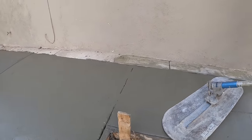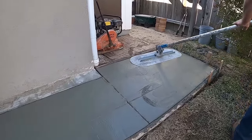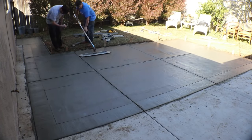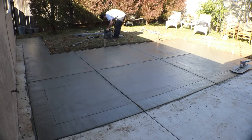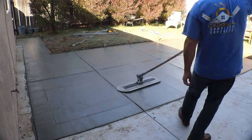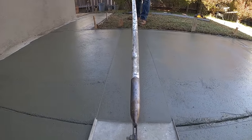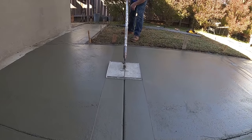So far I just cut it with the deep cutter, 2.5 inch, 3 foot long. That gets the joints nice and straight. It breaks the aggregate deep. And then I'll follow it up with a 3/4 deep, 1/2 inch walking jointer. Big blue is just flattening it out, knocking out some edger lines, jointer lines, sealing it up, because this is going off pretty quickly because we have the high PSI in here at a low slump. Not a lot of downtime when you put them in like this.